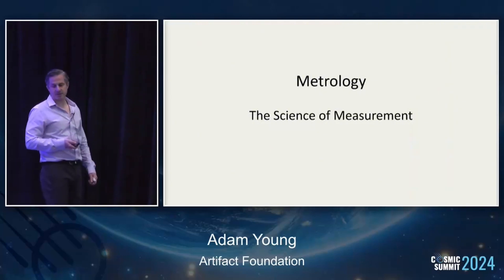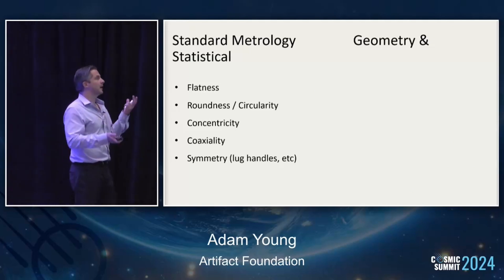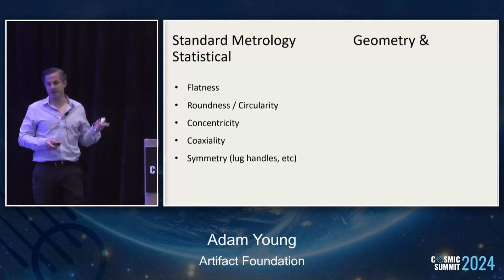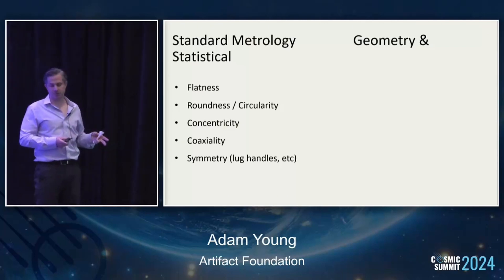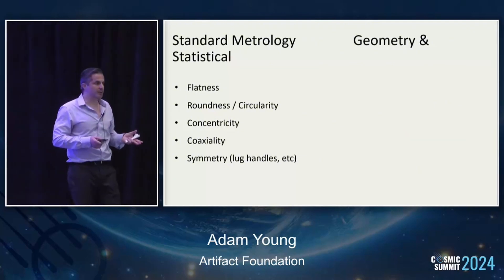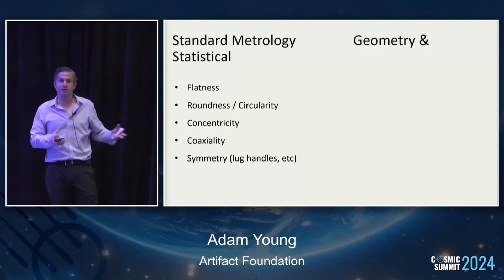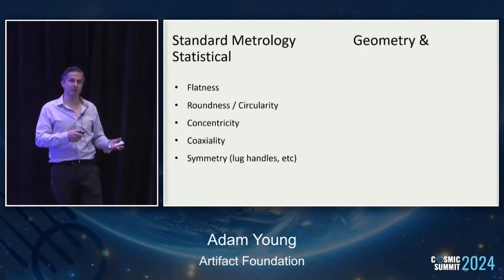Metrology is the science of measurement — how do you measure things correctly? We look at things like flatness, which is the change in elevation; roundness, which is how true something is to a perfect circle; and concentricity and coaxiality. These can tell you how much the machine might have been moving while cutting, how rigid it was, how much friction or vibration was present, and how productive the tool was. Concentricity and coaxiality can also tell you if several different machine setups were used — like stopping and starting. If something was done by hand over the course of years, you would expect that measurement to be massive, because you were constantly stopping, coming back the next day.